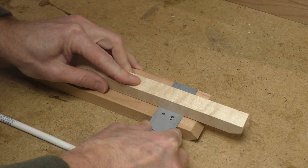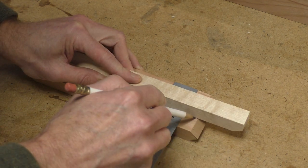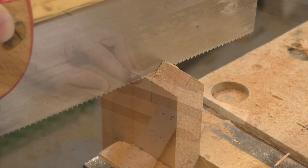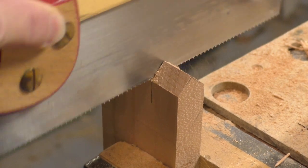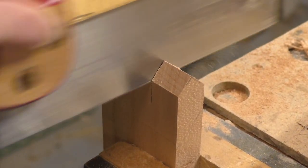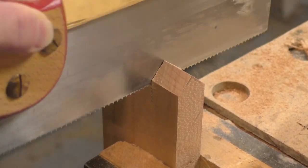Next, I prepared to cut the slots in the top of the support arms where the ski supports will connect to the arms and pivot. In trying to minimize the number of tools I'm using, I decided to hand cut the slots using a dovetail saw and then remove the remaining wood with a chisel. This worked okay, however, if the cuts aren't exactly square to the face of the arm, it means that the ski support won't align or pivot properly.